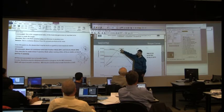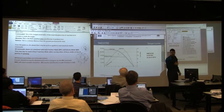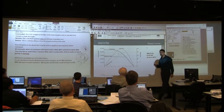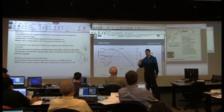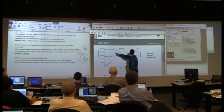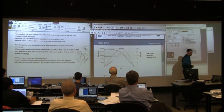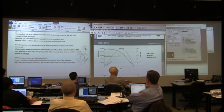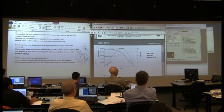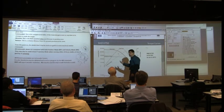The reason we offer this is because mostly in Asia, and in some places in Europe, they advertise servos in wattage. But here's a little known fact: if you say you want a 200-watt Sanyo Denki motor, or a 200-watt LG, Yaskawa, or Yokogawa motor, what they don't tell you is that's at 3,000 RPM. The Asian market is probably around 3,000 RPM. Well, look at this — at 3,000 RPM I'm down to 180 watts, but at 4,000 to 5,000 RPM I'm up at 225. That's the other reason we show those power curves. To tell me you've got a 200-watt servo — that doesn't mean anything. 200 watts where? 3,000 RPM, 6,000 RPM, or 50? Just the wattage of a servo means nothing.